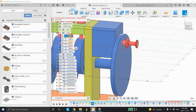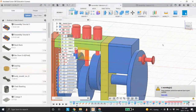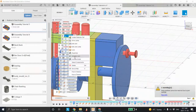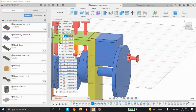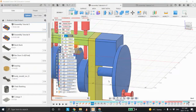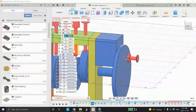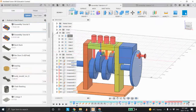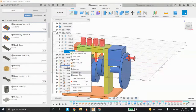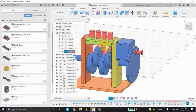Why is it driving through? Because it doesn't know it exists. So let's go back in and enable a new contact set. We did contact sets earlier — let's tell these two parts they exist relative to each other. It's going to say warning, for sure. Now animate the model and see what happens. It knows that block exists. It's supposed to be in this forward position but it's hitting there and moving the block out of the way — so it's actually working the correct way. That slider pin: if I animate that joint, you can see it goes into there and back out. It slides perfectly.